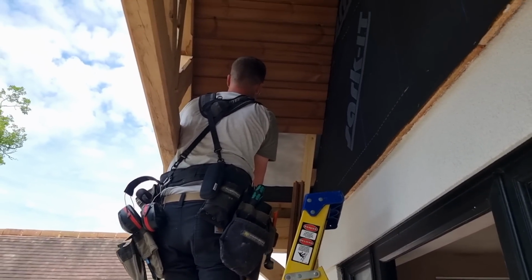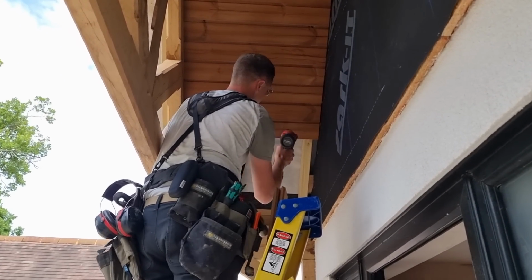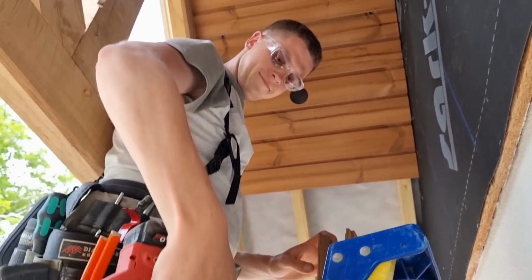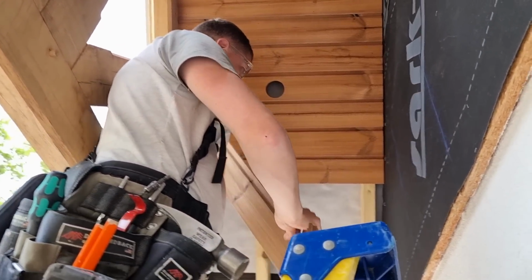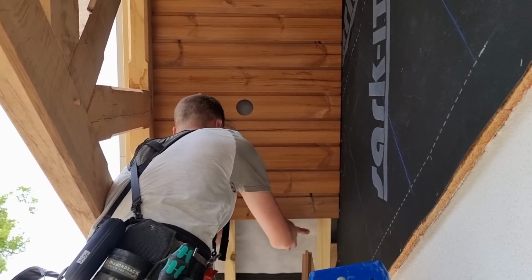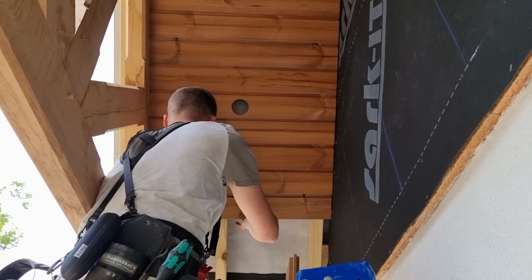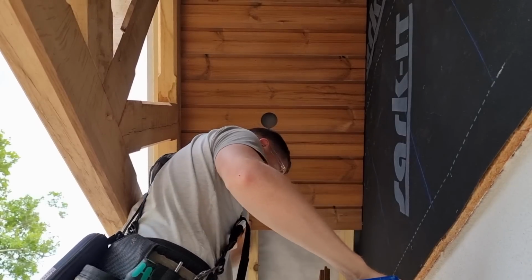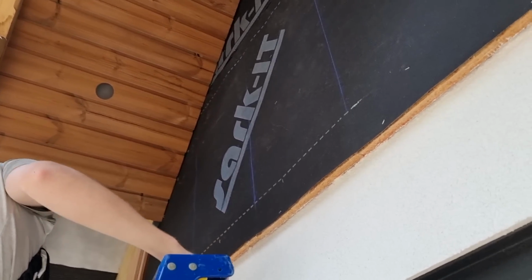So we've got all the way down to this section. We're flying through it. We've also got a couple of downlighters that we've positioned and drilled out as well, and that's a lovely job there. Look, we've actually allowed for the thickness of the cladding that will go on that gable to make sure that lights are obviously positioned in the middle. And we've also run it on that strip of cladding that's in line with our strut from the front of the gable, if you like, from the truss. So I think that's quite a nice detail as well.